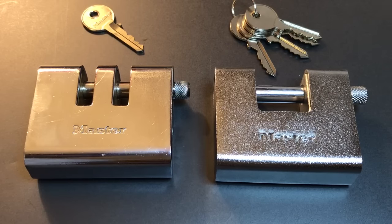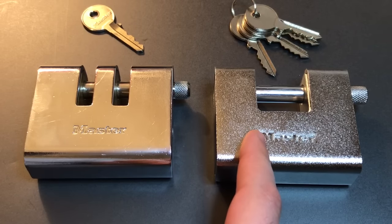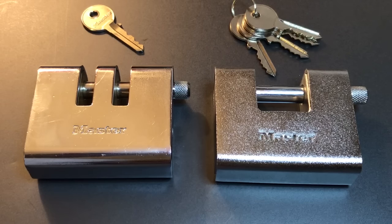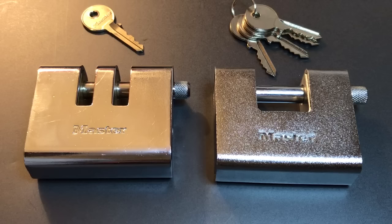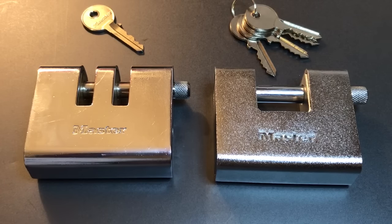The second was the body of the padlock. Underneath the armor, this has what felt to be a cast zinc core, and possibly even a hollow one. It's a very light lock, and zinc is not a very good material to make a padlock out of. Usually locks like this, which are very common in Europe, have brass bodies. So the question is, did we do any better with what I believe to be the older version of the same lock?